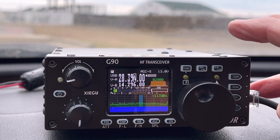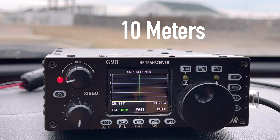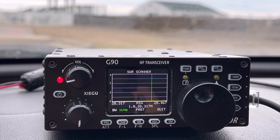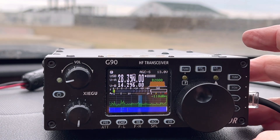Okay, here we go. Let's check SWR on 10 meters to start with. It's pretty flat — I don't think we're going to have to worry about the ATU here on this one. That's pretty solid. So this antenna is awesome, although it calculates out to be about a quarter wave on 25 megahertz. I think I may be wrong on that one. Let's switch to 12.